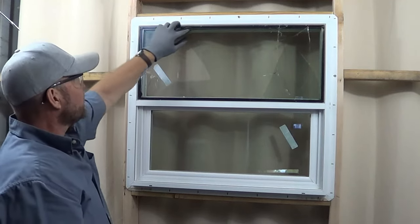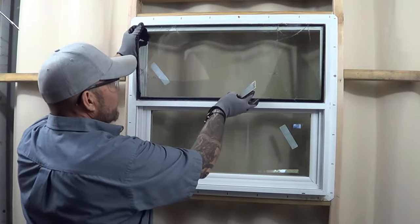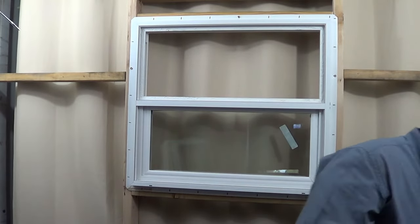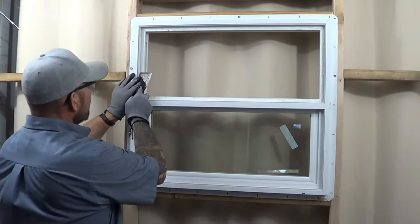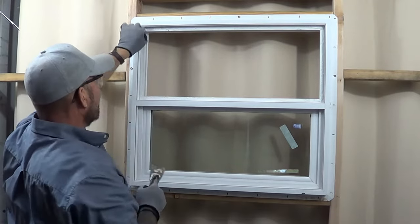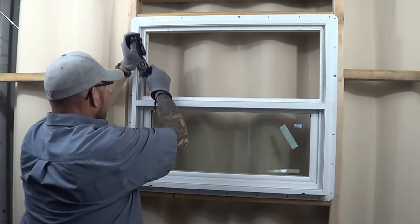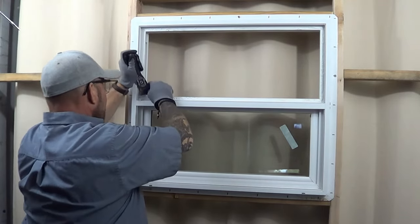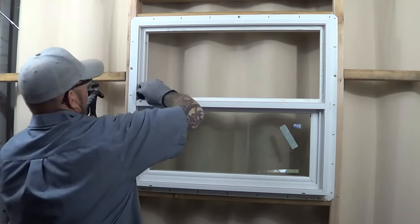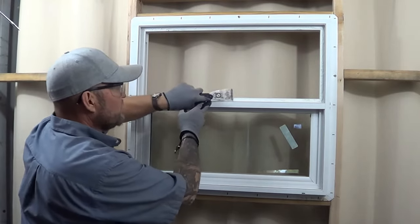So here we are outside. We're going to take our tape off, and this window pane is basically going to fall into our hands — really carefully. We're going to take that all the way off and set it to the side. Now we're going to take our scraper and scrape this old seal off. We want to be careful not to scrape into the material and mar up that edge. Try to get most of this off. We do need to get a clean edge, but not 100% perfectly clean. You're just going to scrape most of that off — it's going to be glue left over anyway. Get all of this area off and then we'll look at what to do next.